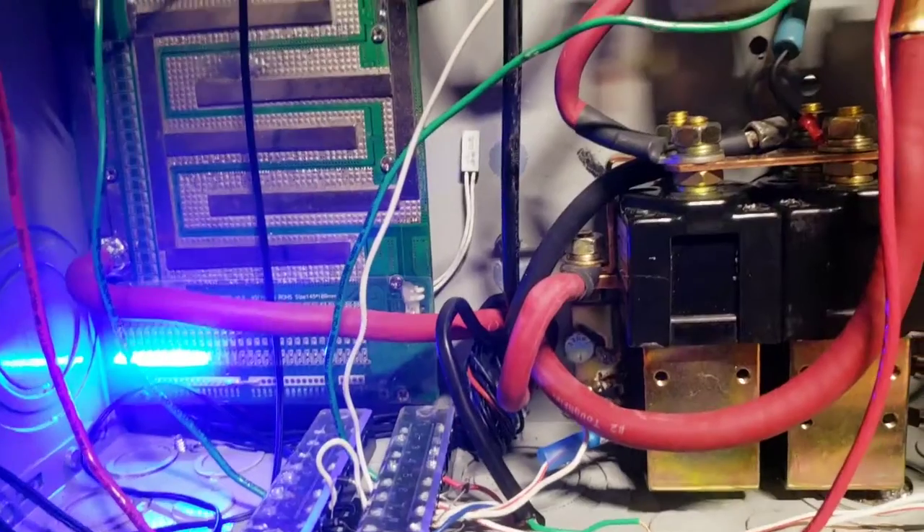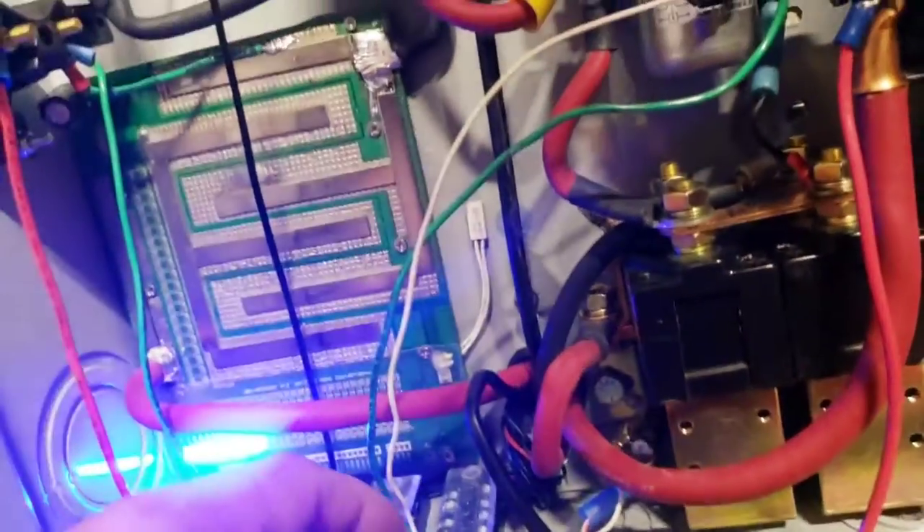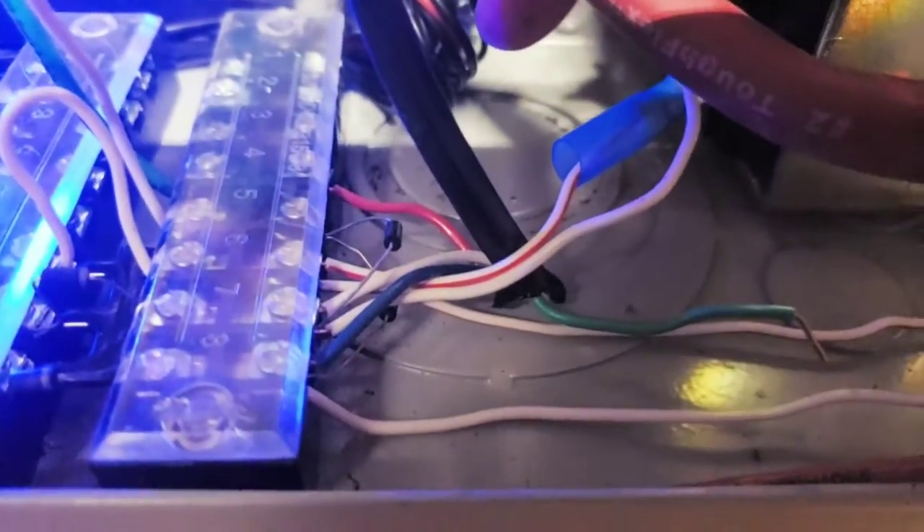In the end, I cooked it once — it didn't blow up, but nothing happened either. I hooked it up a second time after rereading the schematic and changing a few things — specifically those two diodes right there. They needed to be flipped and hooked into a different point. Once that was done I thought that solved the problem. I'm hoping the half-speed issue is just a misunderstanding or the BMS actually doing its job.